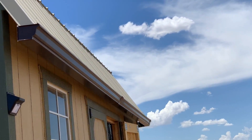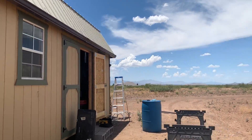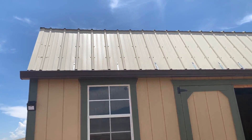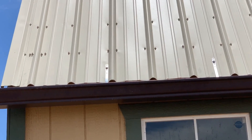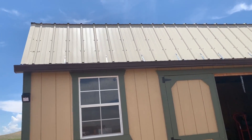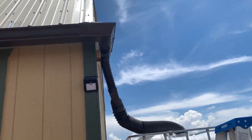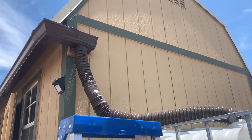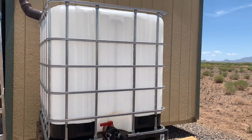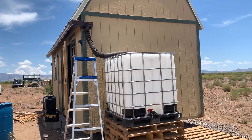There's the gutter right there. We just have gutter for one side for now, but we'll get the other one soon. Because of the type of roof we have, we had to hang it a specific way. It's a slight slant so that the rain just slides down over here. Here's the connector into our container, which is on pallets so that it can be gravity fed as well — all about that gravity feed.